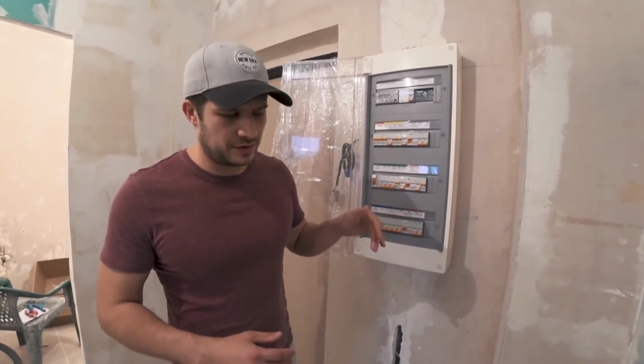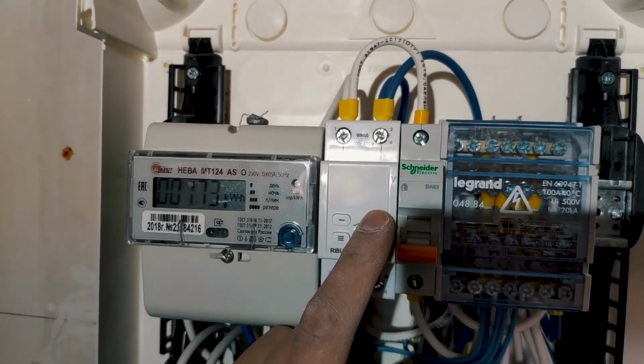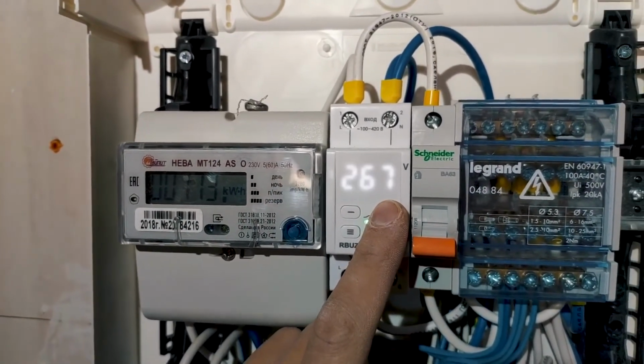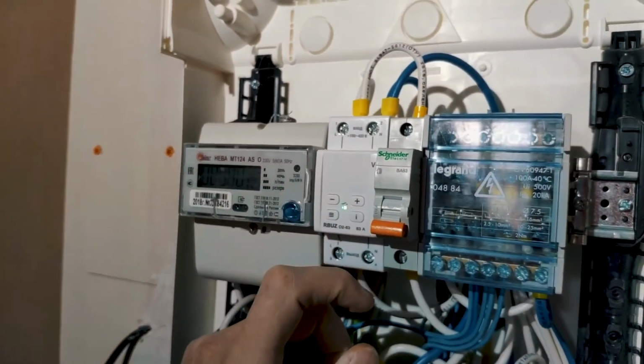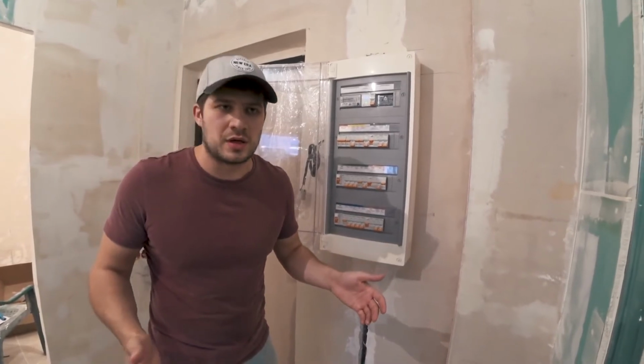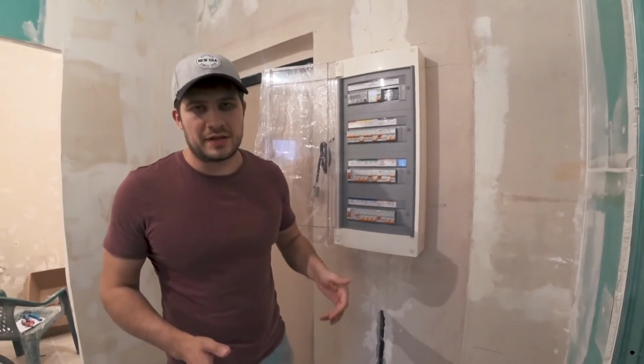We took a look and figured out the settings, and we increased that limit accordingly. We set the lower threshold and the upper threshold. Technically, our standard is 220. However, in an apartment building, in a city complex, you'll see service voltages usually higher, roughly 230, around 230, sometimes 235, 240. So of course, the trip threshold needs to be set higher.